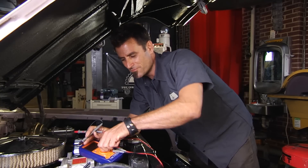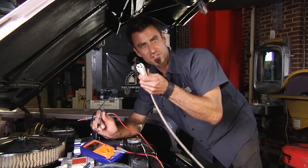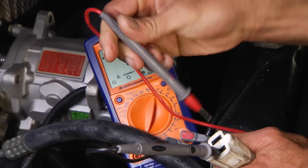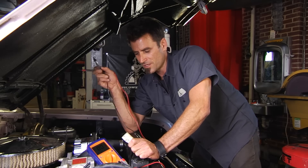You can also check for AC volts. All you need to do is turn to a 110 outlet. Put one lead in one side and the red lead into the other. That looks good — so it's a good way to test at home to see if you have any circuits out.